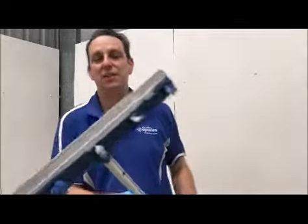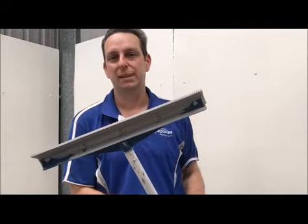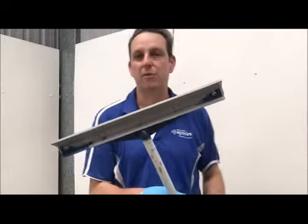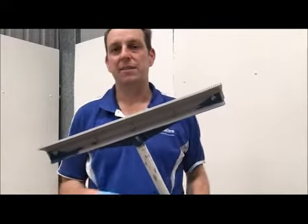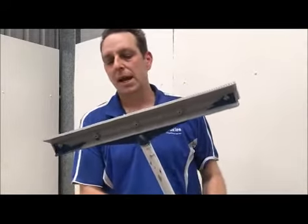So I've literally just finished on the floor doing about 50 square meters of this mezzanine, and it's a single coat of solventless epoxy. I wanted to get down at that sort of 200 micron mark, and I'd worked out my calculations based on that across the 55 square meters, I think it is. And the way I was going to gauge it, the old-fashioned way, was to mark out sections and pour a certain literage, knowing the volume over the area, and you work it out exactly.